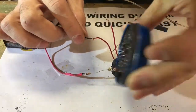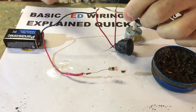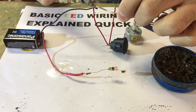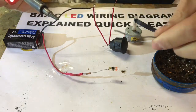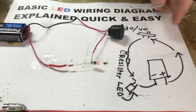I've never soldered before — I've just twisted my wires together. I have some flux here; I'm gonna put a little dab on there. I have my solder and it's real easy. I'm just throwing this in just in case there are people that don't know how to solder. If the tip on your soldering gun is dirty, take a piece of sandpaper and rub it so it can make contact. If your solder is not heating up, that's what you want to do — clean your tip off.